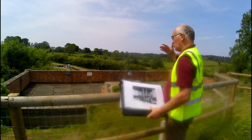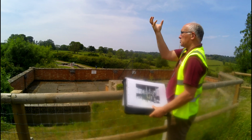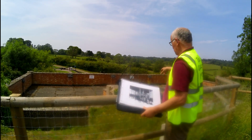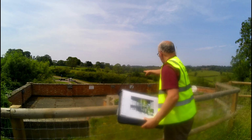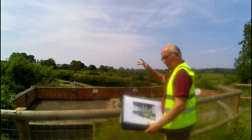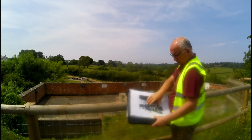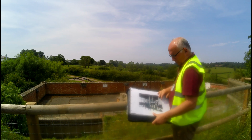You go into the museum, you look into the tunnels, which are by the wall, the left-hand wall. If you look up, you'll see bolts coming down. Essentially, as you see on a lot of old buildings, these bolts go on either side to hold the wall together. They're using the same system here. You can actually pick out the big iron rods that are coming through the concrete. Those go all the way down through concrete, down into that tunnel, and then you'll see the bolts at the roof level of the tunnel. So they're holding this mass down, which makes a lot of sense because you've got 500 tons up here. You need to bolt this down fairly well.